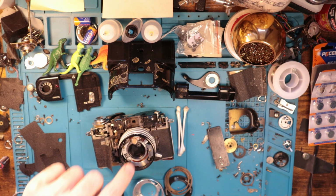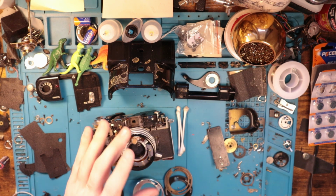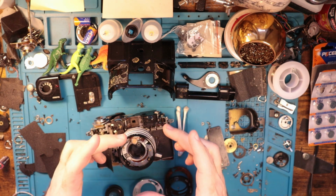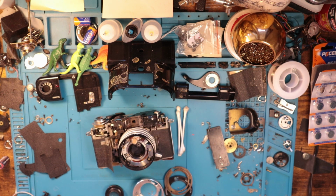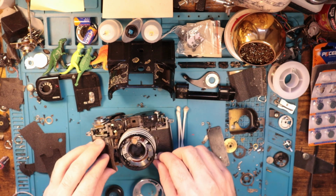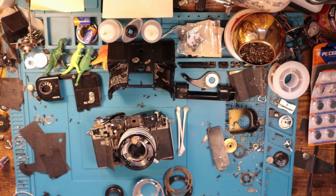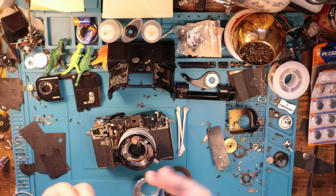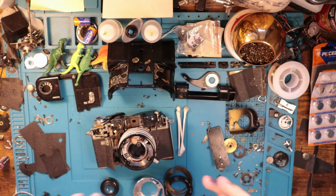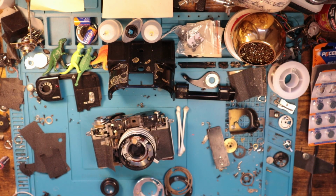It was that issue, but then also the blades themselves of the shutter were oiled up. Very common, unfortunately, with these cameras in particular, just because of how the shutter sits in the lens. Basically, all of the grease that was used to lubricate the barrel for the focusing ring seeps into the shutter system over time. It's a whole deal. It's also why you see a lot of these having foggy elements or mold infestations. There's stuff in there, and over time it just festers. So got that cleaned out, got that taken care of.